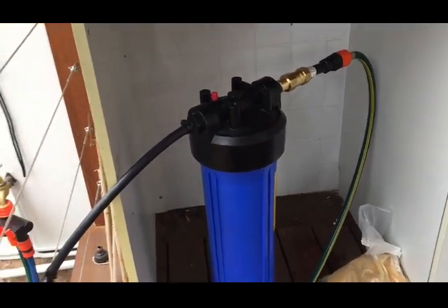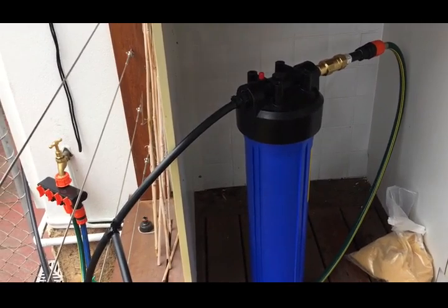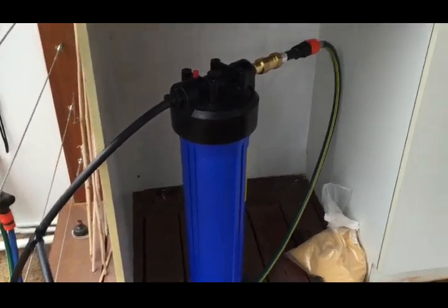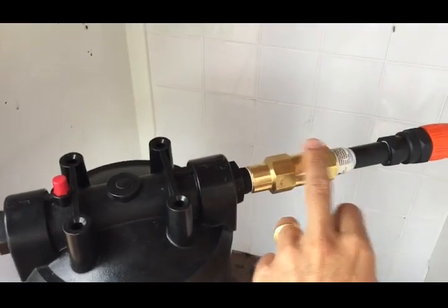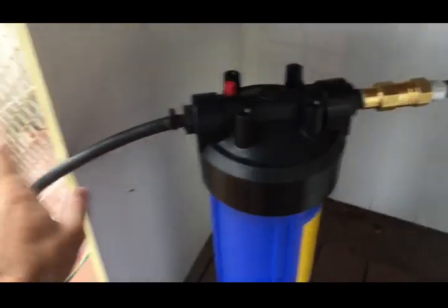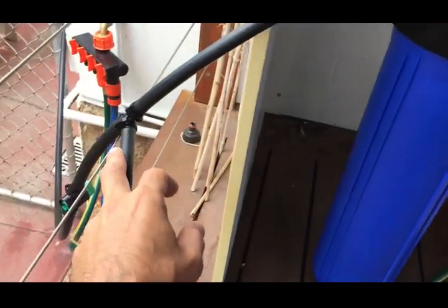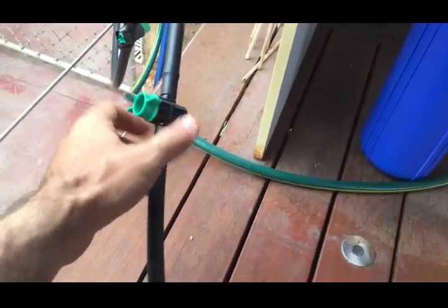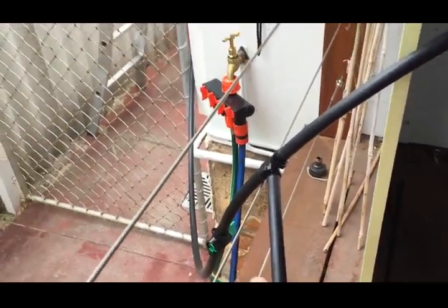With sodium exchange you end up with sodium carbonate, which isn't a big deal since it's very water soluble — you might see some crystallising out but it'll just wash off. That's the water supply — a standard garden hose fitting. There's a pressure limiting valve at 600 kPa to make sure you don't exceed system pressure. The softened water line can also supply the coffee machine or be used for backwashing. That line goes up onto the roof — let's go have a look up there.